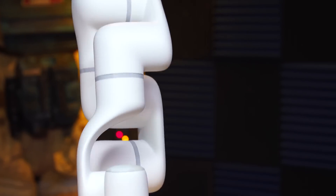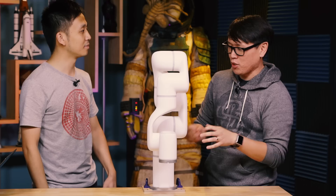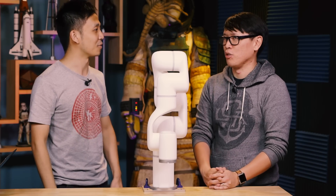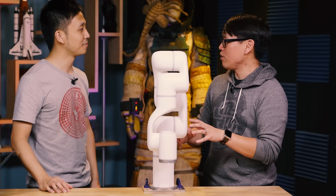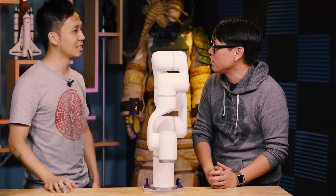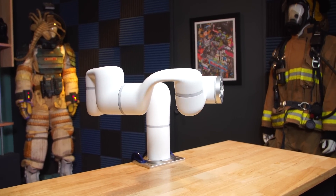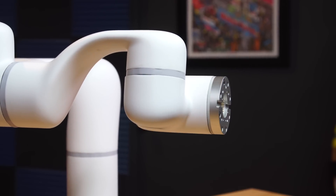So when you're designing this mechanically, using that analogy — like my arm, I can reach very far but also have the strength to hold things out very far. So when you're designing something like this, what's the load capacity and can it maintain that? For this arm, it's like 3,500 grams — about 3.5 kilograms. And in terms of precision, if you program in a series of actions, it can repeat that to about 0.1 millimeters. That's pretty good, because it's based on an industrial robot design — still powerful compared with an industrial robot in terms of payload.